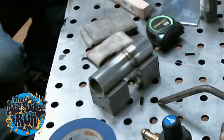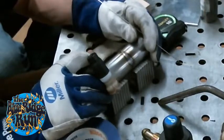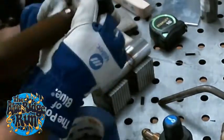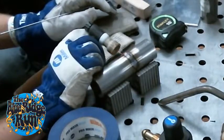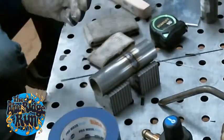And then notice you're always snipping the bad off, but we'll roll into the weld and try to make it to where you don't see the start and stop. So I'll start ahead of it slightly, back up, and then when you pulse, you see how big. I'm just dabbing right on the edge of the weld.